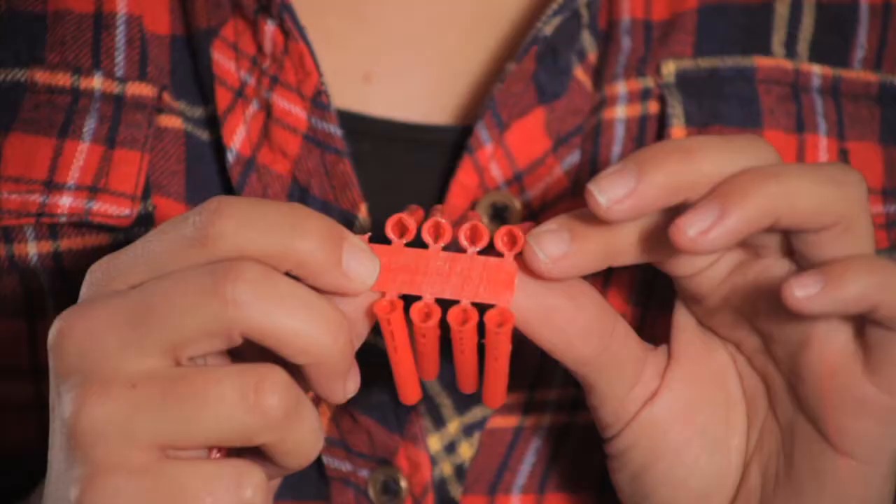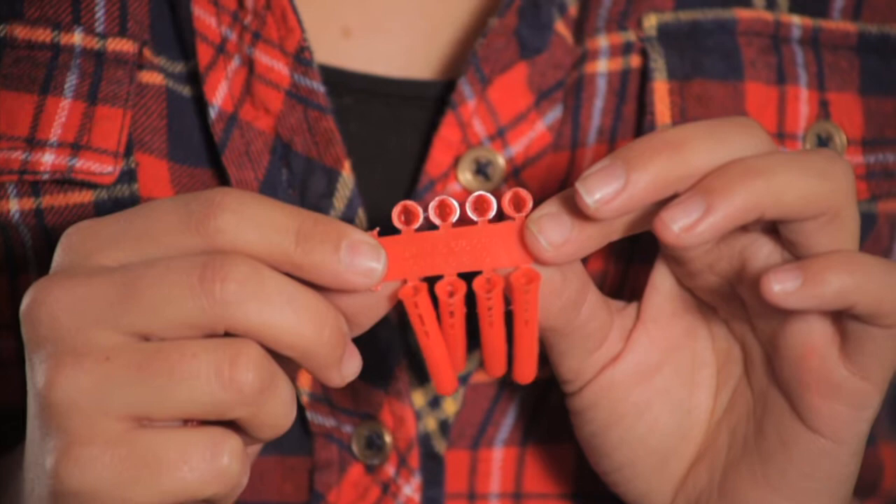So I know that behind this wall is breeze blocks. It's a nice strong wall and I'm going to need to put a wall plug in there to make sure the screw is secure and holds up my picture properly. I've bought some wall plugs already and it's telling me on there that it's 5.5 to 6 millimetres — that's the diameter of the wall plugs, and that tells me exactly what drill bit I'm going to need. It's also on the package sometimes, and it will also tell you what diameter screw you're going to need.